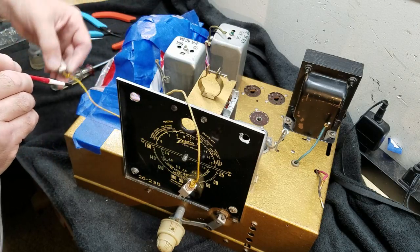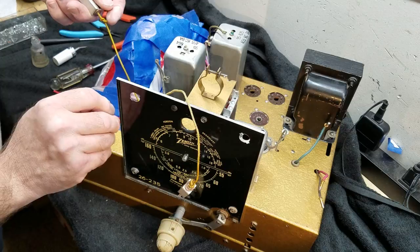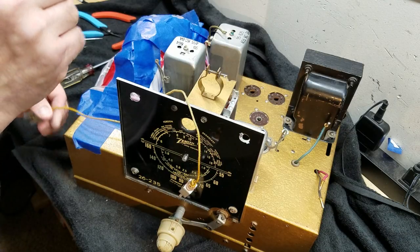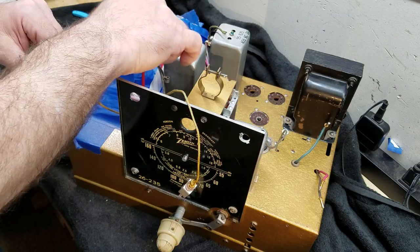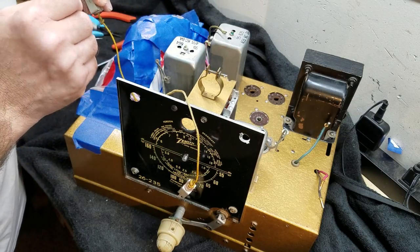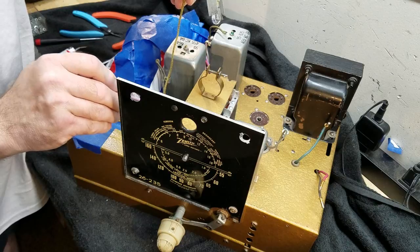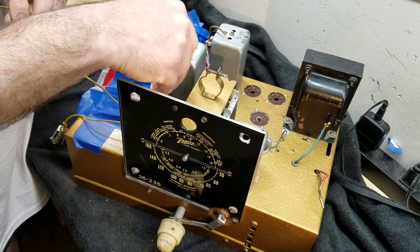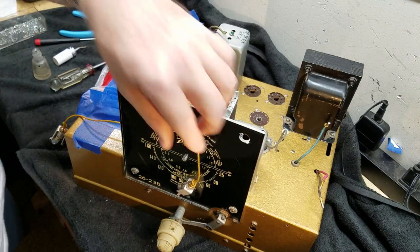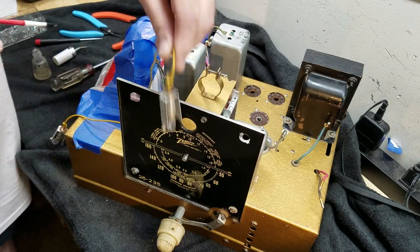Aside from looking nice, it will protect that cloth from breaking down over time — humidity, heat, and sunlight all break down cloth insulation. It lasted a long time because it's not generally exposed to most of those elements, but the older it gets, the more fragile it gets. Some people ask why I'm putting lacquer on wire — well, the manufacturers did that too. If you ever buy cloth wire that looks like it has a coating on it, that's lacquer. Some manufacturers put a waxy coating on wire, but generally it's a flexible, soft lacquer.